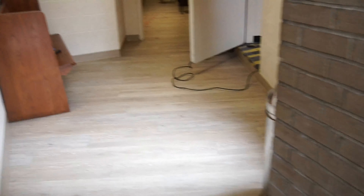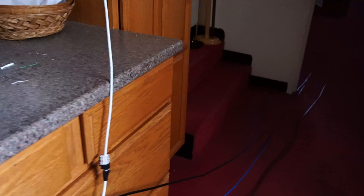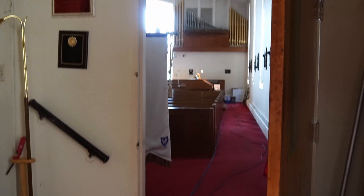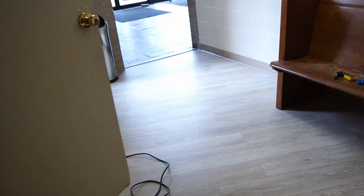I must apologize — my mic actually died here, so I'm adding this after the fact. I had to drill a hole here because the existing hole was not big enough for me to run the cables. These are the two cables coming from the front PTZ that we got into the hallway. I had to open up a hole in the ceiling to get that. I've relocated the internet to go in that place. We're going to put a conduit up there to hide all these cables. We have two SDI cables — one going to the projector, the other going from the front camera — and the blue cable is the Ethernet. I am pulling this down the hallway, got it all the way down to that door, but that door was locked.